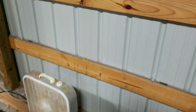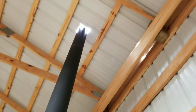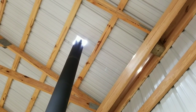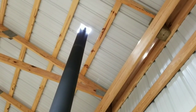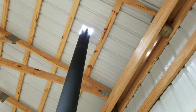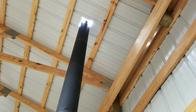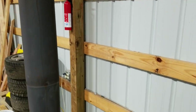From the wall to the center of my barrel I'm three feet. I just kind of went up through the ceiling and through my roof — I'm going to get a rubber high-heat gasket and put around it, I haven't ordered that yet. But I do have a chimney out the top with a rain cover and everything, and I will be putting a double wall or triple wall insulated stove pipe through the ceiling eventually. Right now it doesn't get hot enough up there to really mess anything up. I did also add a fire extinguisher just for safety reasons.